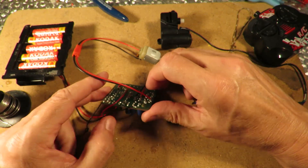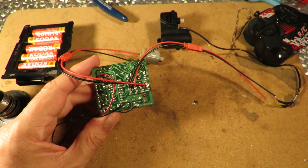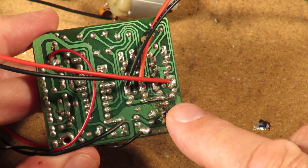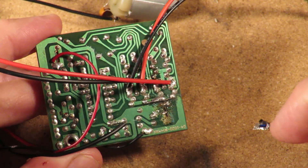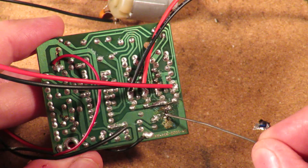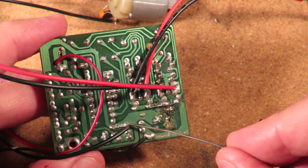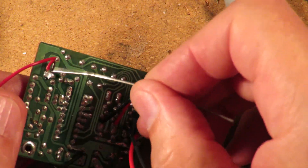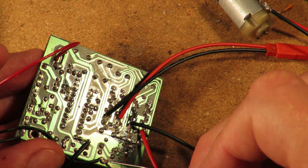The circuit board itself was in a pretty poor state - obviously there's been some corrosion. I actually had to strap it out where it corroded right through the copper tracks. Along there it corroded right through, and all around here was corroded. That's where the negative wire should be connected, but I've just followed the track along and connected it along here instead. The positive track is connected there and then it goes away to the on/off switch and actually turns up down here.